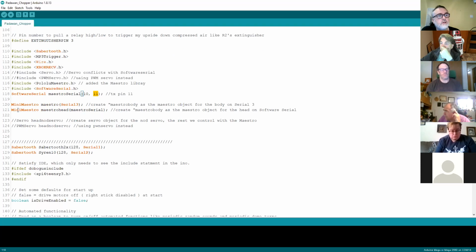The second one that I've got here is linking the particular type of Maestro. There's a micro Maestro and a mini Maestro. We're using mini Maestros, and it's saying we're going to create something called a Maestro, link it to serial 3, and we know it's a mini. And then the second one, we're going to call it Maestro head, and we're going to link that to the software serial port that we've created. Does that sort of make sense?